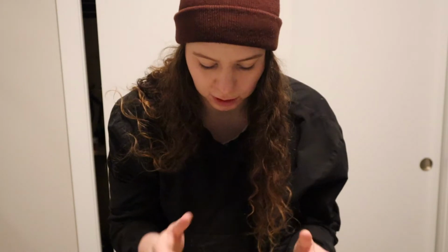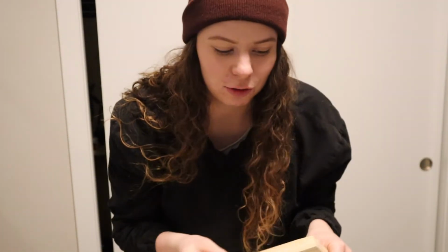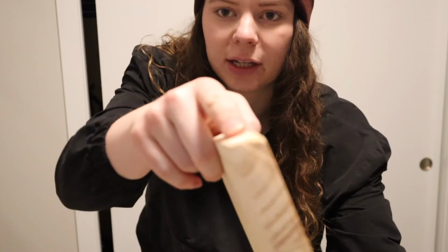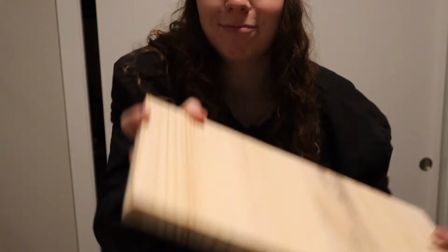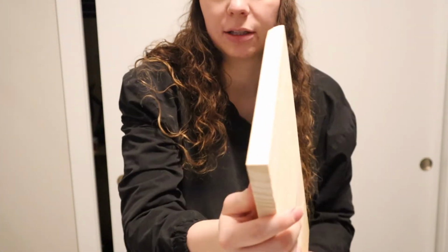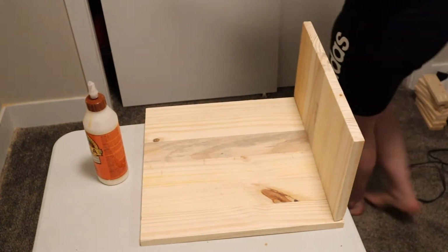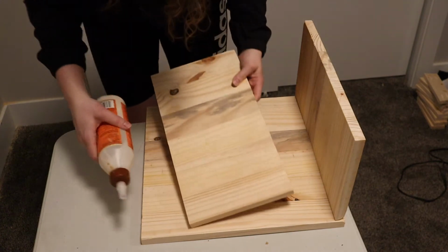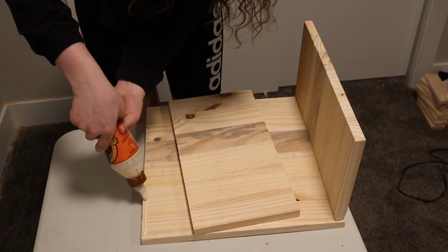So when you're doing this, you want to pick a front side, basically just a side that looks the best, the cleanest cuts, because even just getting it from whatever retailer you choose to buy your wood at, it can come with cracks like this one in the front, see? And I want a clean edge on my front, so something that looks more square. So the first thing I do is just to line it up and then dump some glue on there and get these squared up.